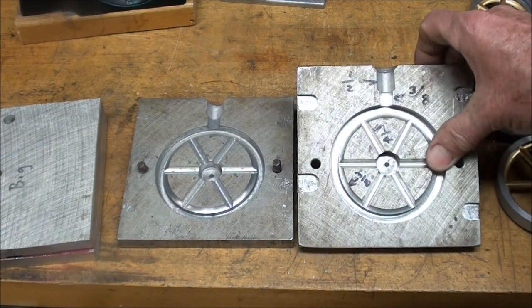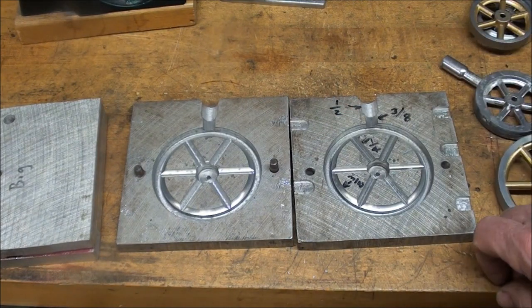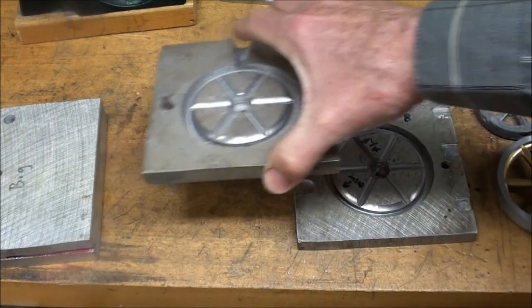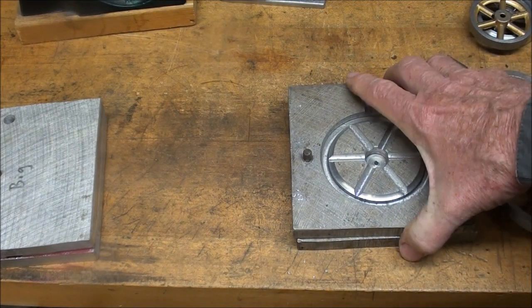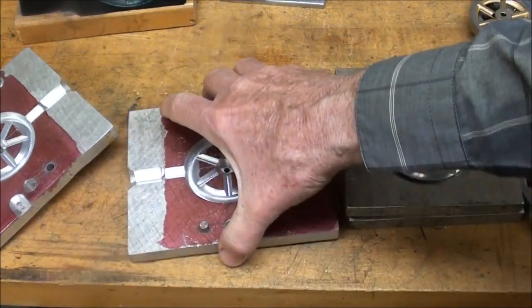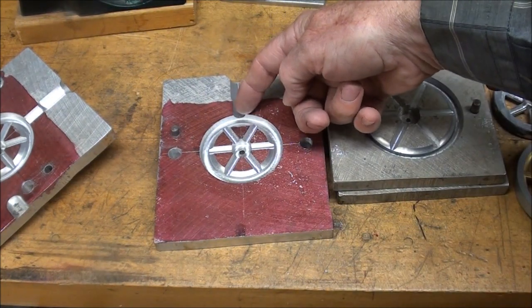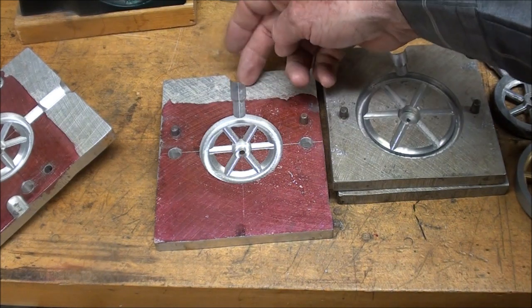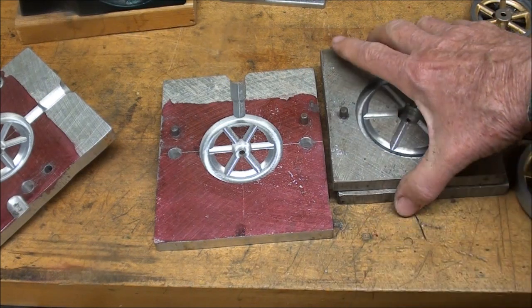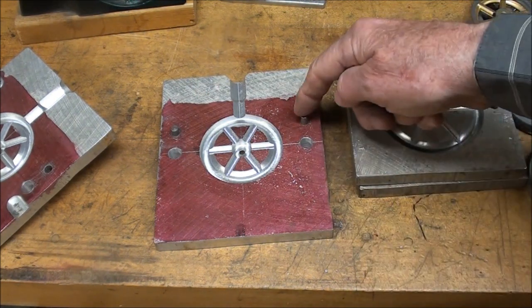These are the alignment pins — the male part and the female. This is like injection molding in a factory with plastic or zinc — they used to call it die cast — but I'm doing it strictly by gravity. On this improved mold I repositioned the cavity within the blank to have a little more head, giving a bit more pressure down into the mold for better castings. The larger holes are from holding it down onto the rotary table.